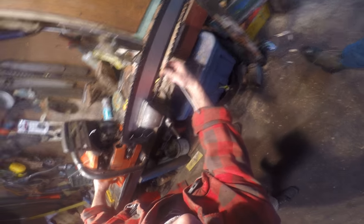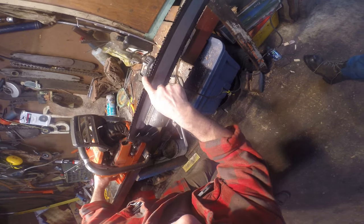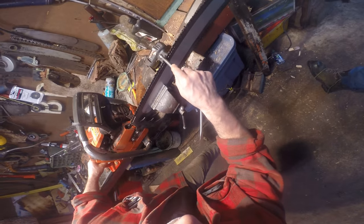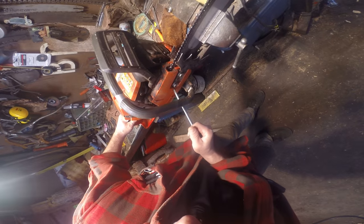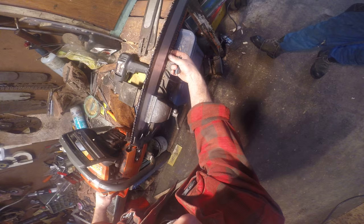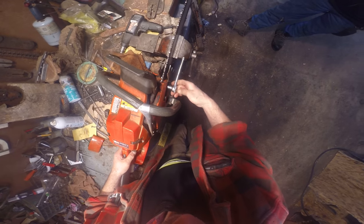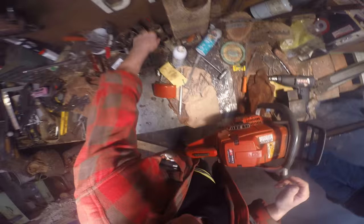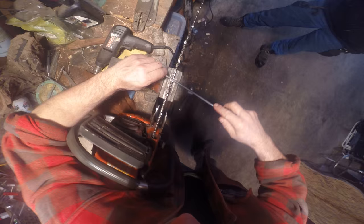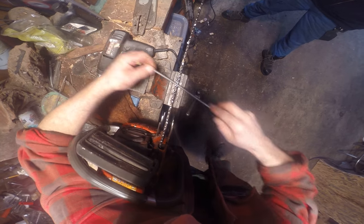A little crank here for chain tension. Here's my chain — it's not extremely loose, but for filing it's moving back and I don't like it like that. All it takes is just literally a quarter turn on there and that's going to help me. Then you throw the old ratchet strap back on there and boom, you're in and out like a fiddler's elbow and you're back on the file. Now the chain won't pop back — you see it's sitting in there beautifully.